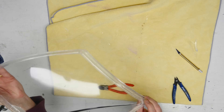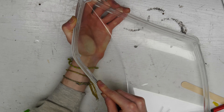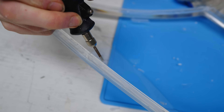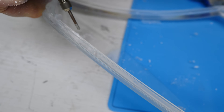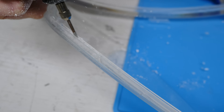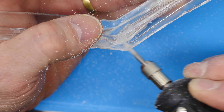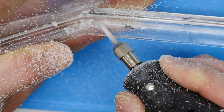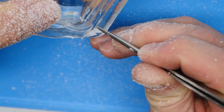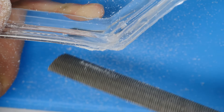In hindsight, we probably should have built a traditional two-part mold with clear split lines that comes apart easier. We've got to dig parts out, and silicone gets caught in that groove - it's not ideal. We end up having to patch the mold back together every single time and do cleanup on the parts. For a volume of 10 sets it's not ideal. Saving the time in the beginning with this cut mold ends up not really being worth it, because we have to spend so much time cleaning up the parts to get nice results for the customer.